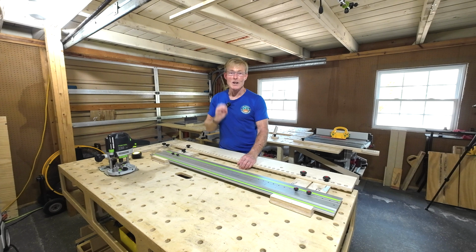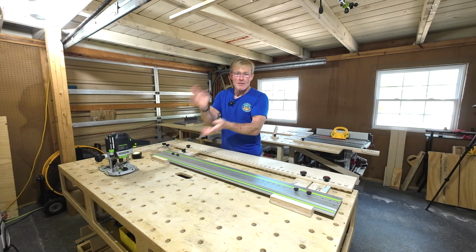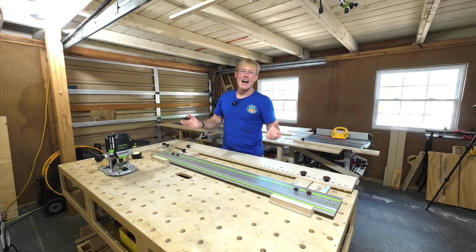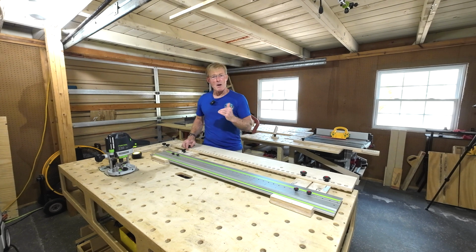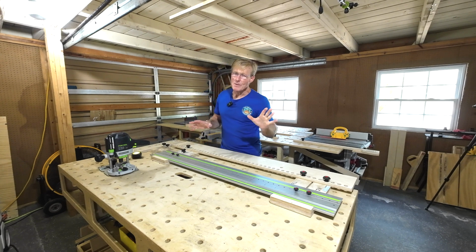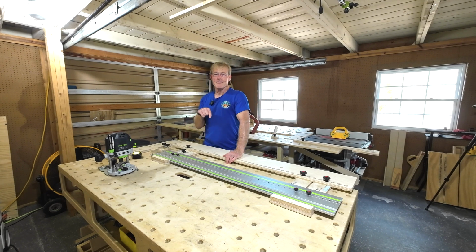This is easy to use once you've built it properly. So you've got it all dialed in. You take your same scrap that you've already cut, flip it over, flip it around, cut a new pair of holes, and march it up. I said 5 before, but the more I think about it, 10 would be even better. If you're off, then take a breath, and you've already drilled these 4 holes. Just go ahead, grab some dowel, put some glue on it, clamp it in there. That's where it'll take a little bit longer because you've got to wait for the glue to dry. And then you sand those off, and then at that time, you'll know exactly, because you'll know in 10, if you're off half a millimeter, you're going to know how much to adjust it. It's going to be slight.